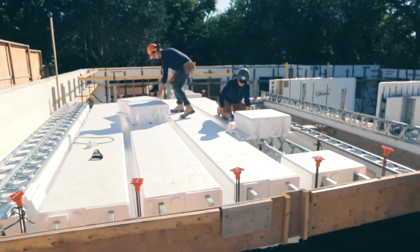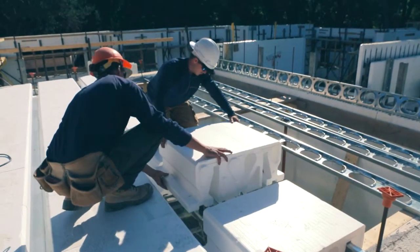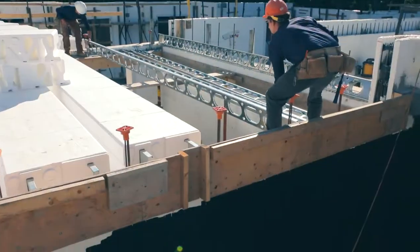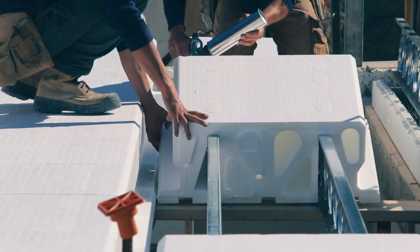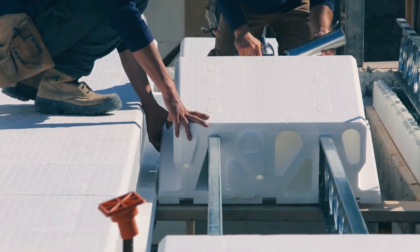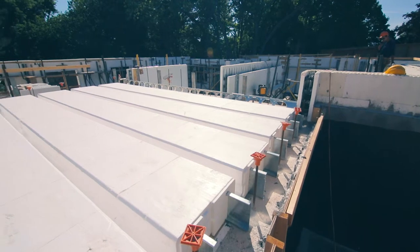Suspended floor installations. Floor systems are most commonly suspended from rim joists or ledgers that are mechanically attached to the concrete with anchor bolts or with a proprietary tie. The Simpson Strong-Tie ICF LC ledger is highly recommended as it simplifies installation and can be used with both wood and steel floor joists.